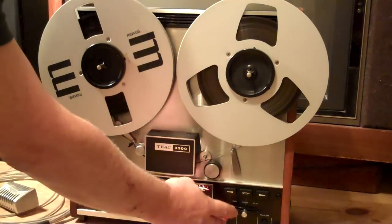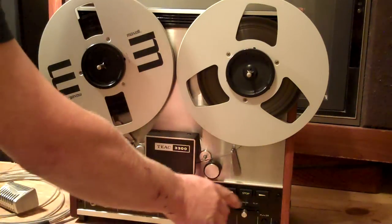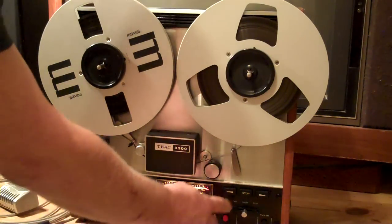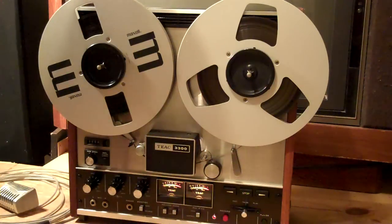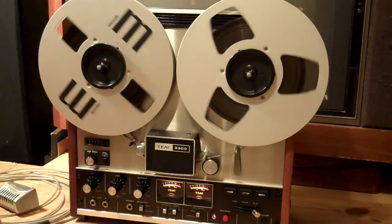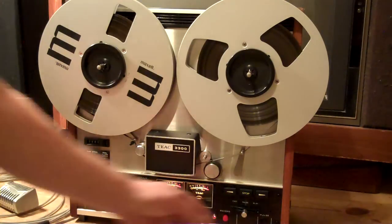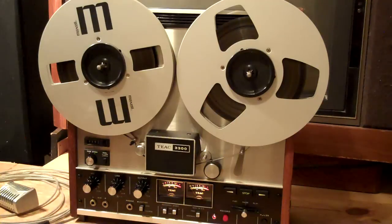The pause button on this thing is kind of interesting. This is the older one with the lever — fast pause and play. By the way, this is a three-head deck. So with this thing set on pause, record, it actually turns the circuit on, and then you can flip this over to play. Flip back to pause, flip back to play, and that's all during the record.